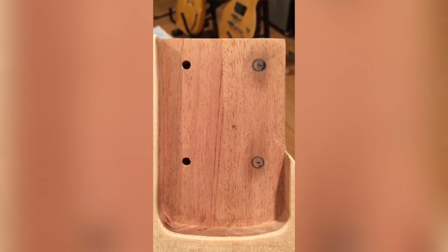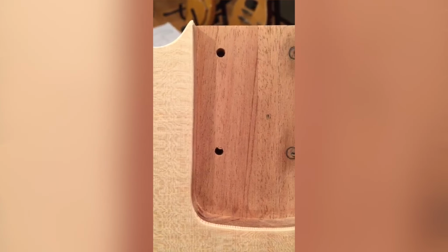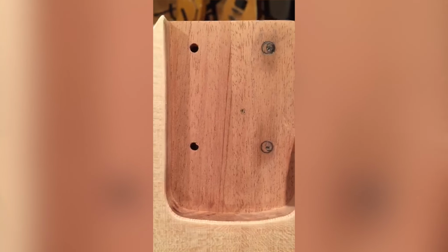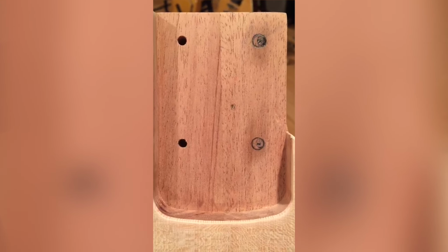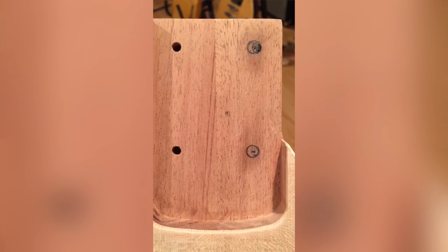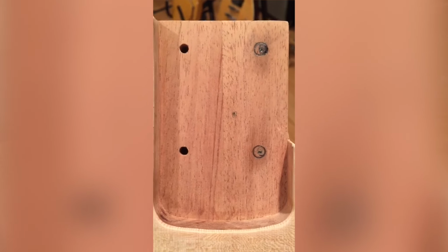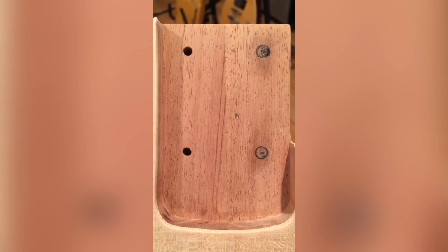You can see here on the back especially, the dowel that I created fit the hole perfectly. It's been sanded down, glued in and sanded down. I used the neck plate. Fortunately, the two holes nearest the neck pocket support were perfect. The other two holes were off. So you can sort of see how far off they were based on these holes I've drawn using the neck plate. So the next step is to properly drill these holes so they're located exactly where they need to be.